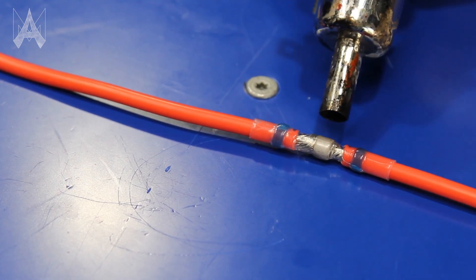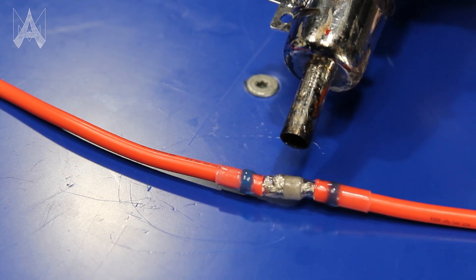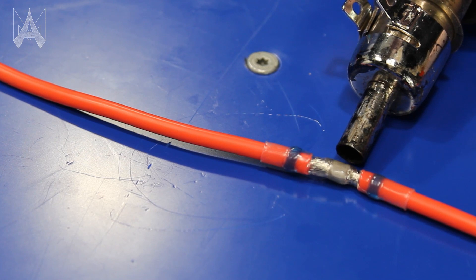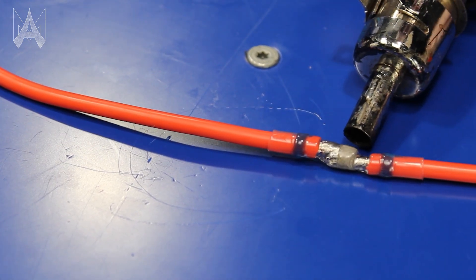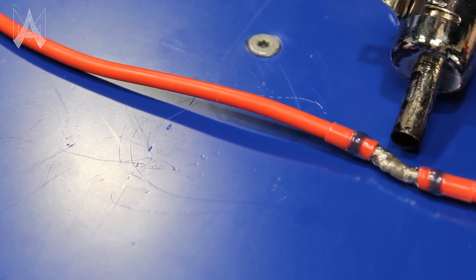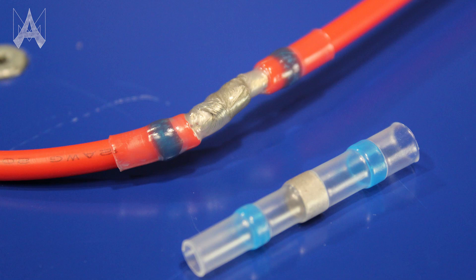The longer the wire, the longer the melting process might take due to the wire acting as a heat sink. I'd also recommend putting more rigid shrink tubing over this, because the plastic shrink tubing on solder shrink tubes isn't really for structure — it's more for sealing the joint. Common mistakes when using solder tubing: not shrinking the glue first so the solder escapes, or not actually melting the solder entirely. You want it to start as a ring and make sure it's completely gone — you can see the wires are actually bonded and all the solder will liquefy, not just get mushy.